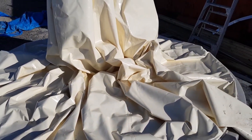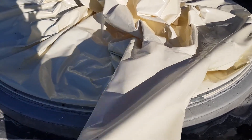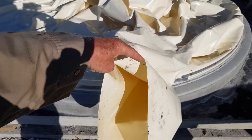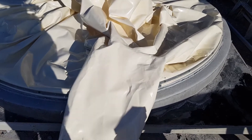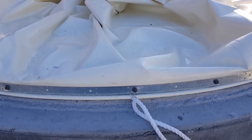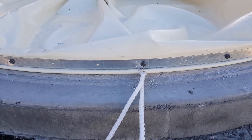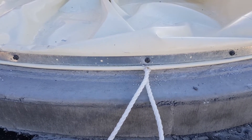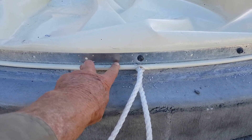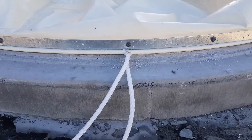We'll fix that down around the perimeter and find out in a minute whether it leaks when we do a test inflate. This is the sock fabricated into the airform — when inflated it's about 400mm diameter so a person can get through, because we will eventually have to get in there. At the bottom of the airform you can see two ropes coming out — these are just the excess of a 12mm diameter rope welded into the bottom of the airform to provide significant hold-down. This band of steel around there holds it down and helps seal it to the slab edge.